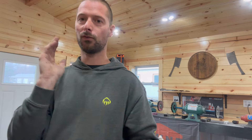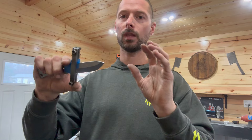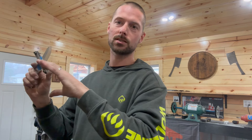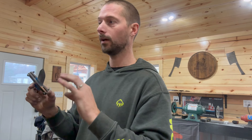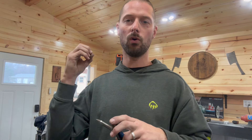Something that needs to be talked about is the freshness of the belts. I see a lot of people that try to get more out of a belt than what you can, especially for bevels. When I'm doing one of these knives, my 60 is always pretty fresh — I don't like to do more than a couple knives with a 60. Once you get to the 120 and beyond, when you're trying to get the best bevel possible, I go with a brand new belt pretty much every time. You can use those for other things once you do your bevels — I use them for the surface grinder, for shaping handles. It's not like you have to throw them away, but when you're grinding a bevel like this, go with fresh, crisp belts. It makes all the difference in the world.